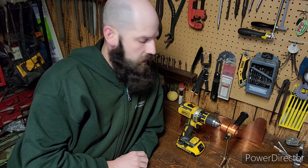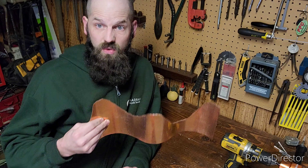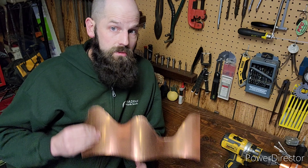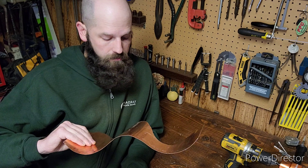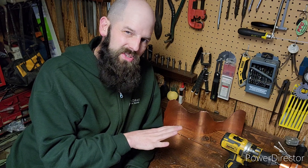So here are my final thoughts on this tool. This tool right here is only $35. If you try and buy an electric nibbler on Amazon, for example, that's going to cost you more than $300. So for $35, again, in tooling, you get what you pay for. I'd say this is a pretty smart investment for people who don't want to put $300 toward a metal nibbler they're only going to use a handful of times. As far as how well the tool does, it does make good turns and sharp turns too — in fact, a little too sharp. There are a couple of places in here I have to go over with some kind of cleanup tool and get rid of all these sharp edges. My only big concern with this tool is, again, those tooling marks. At first I thought those marks only show up on the front side of the cut, but they actually turn out on both. So if you're using this for art and you want some really nice, clean, and pretty lines, I don't know if this will work for you or not. This is going to require some significant cleanup — that's why we have power tools.